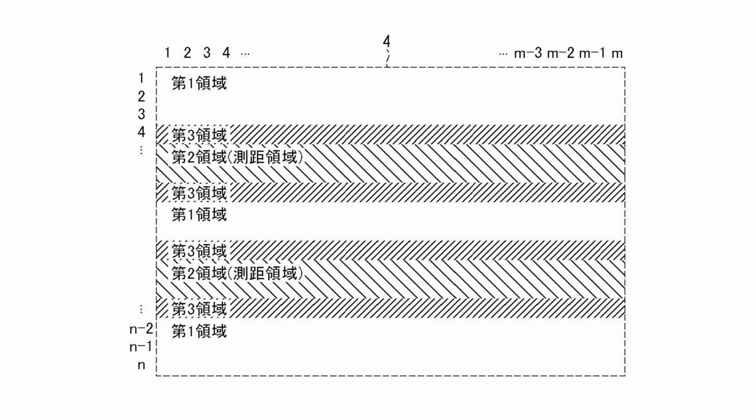Figure 4 shows us the array. It's split into 3 regions. In the first region, the outcome is fast, clean image data, no focus taps. In the second region, the sensor outputs both the focus signal and the image signal. And in the third region, the sensor mixes rows from each mode to make the handoff seamless.